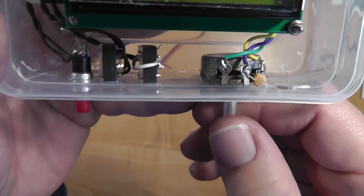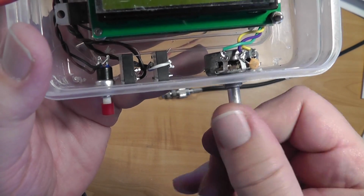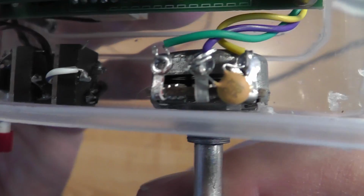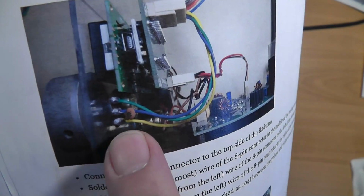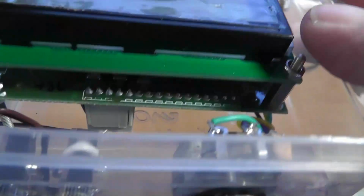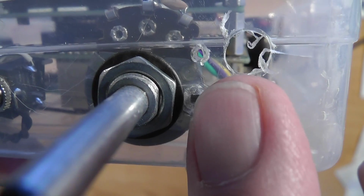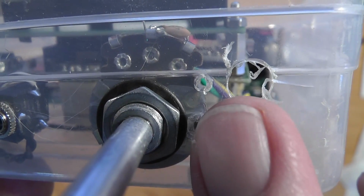The rig's operating frequency is set by a potentiometer. Note the small capacitor mounted on the pot. I note that it is easier to follow the wiring in the photographs rather than the diagram. Oh, and I note that this and the volume pot have small tabs that can go through a hole to keep the pot in place while you turn the knob.